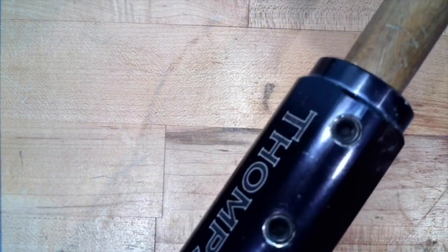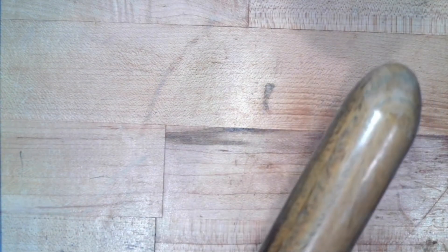It's a three-quarter inch, 16-inch handle, and the wood is just held in place there with two set screws. This actually works quite well on aluminum — I probably wouldn't use it on copper or brass or anything that's more difficult to spin. That came out of a question when I was doing some demos for a woodturning group to see if that was even possible, and it piqued my interest and I got that going.